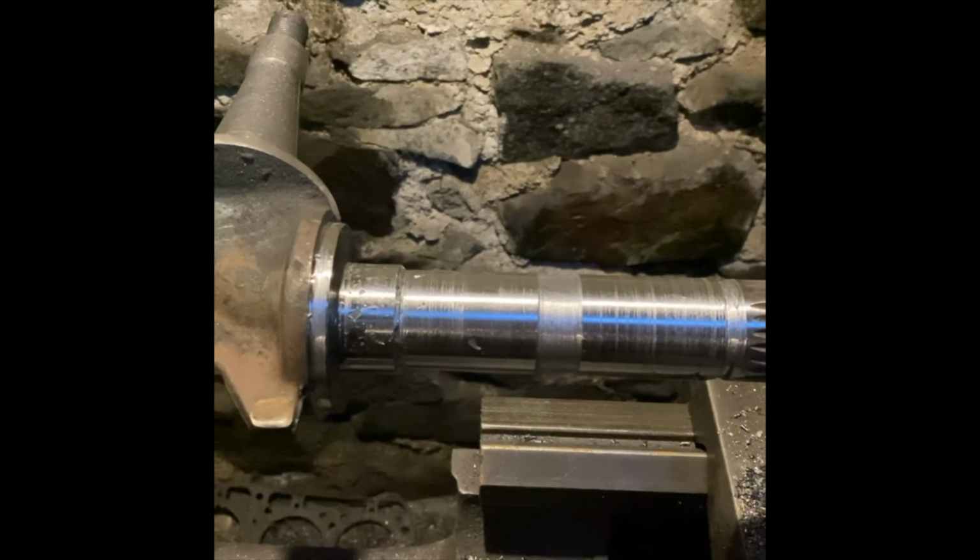I had the kingpin, or whatever it's called in the Ford book, in, but it was too tight, so I brought it out and sanded it down. I've cut a 4 TPI left hand Acme thread in it to let the grease come up. So I'm going to try it back in and see if it's turnable now. You had to turn it with a bar, but it wouldn't move, just too tight.